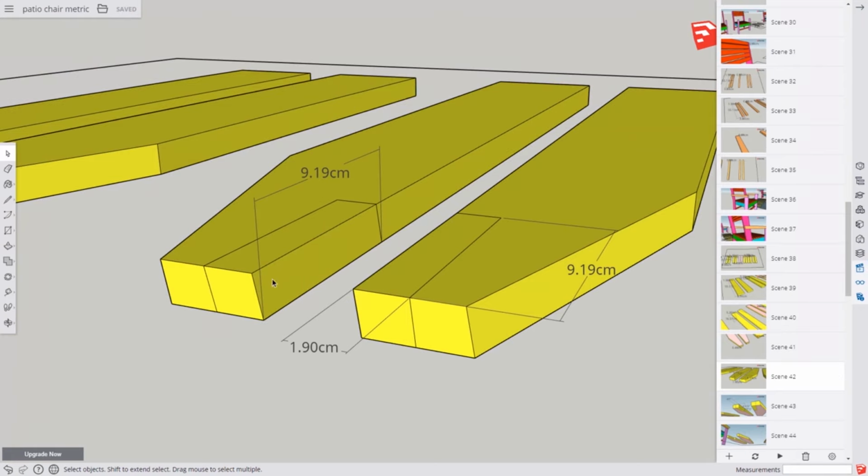Last thing we need to do is cut off the area that will occupy the backrest supports that come from the legs, and so we'll cut in the width of that as well as their lengths with that angle. So this angle does become important at this point, where if you decided not to cut that angle, you're going to have to measure that out some other way, because right now this point to this point is equal to this point to this point, which wouldn't be so on the bottom side if you didn't cut that wedge off. This would be a longer cut in, and so you might just have to add that spot that we didn't cut off onto here.